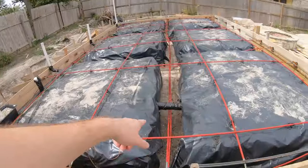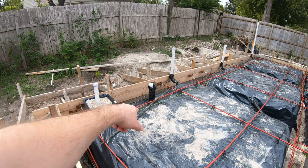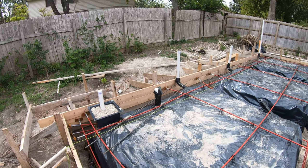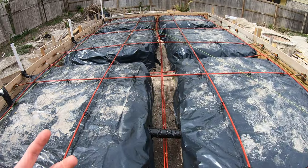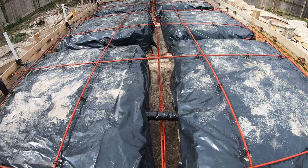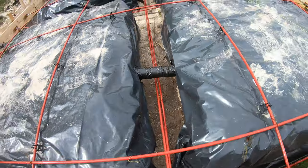One thing I had to do — we actually failed the plumbing rough-in first because they didn't wrap these pipes. Concrete is not supposed to touch the PVC at all. You can see right there, that's the toilet plumbing. The plumber was having some family issues, so I just came out and basically took some thick contractor bags, wrapped them around there and taped it with some all-weather, really sticky tape, and connected it to the vapor barrier here — just to make sure all that piping was not going to touch any of the concrete when it's poured. So I put that on there, had them come out for another inspection, and we passed it.